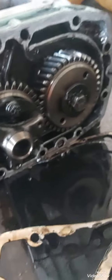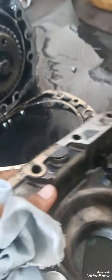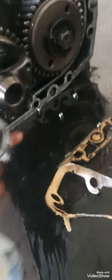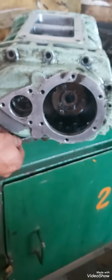As you can see, I have marked both sides of the covers, because at one end a fresh water pump is fitted, the other end has a drive for the governor, and the other end is the drive from the gear and also a drive for the fuel pump. This is the cover — I removed the cover by opening all the bolts. As you can see, this is the drive for the fresh water pump. Remove the bolts from both ends and take out the cover.